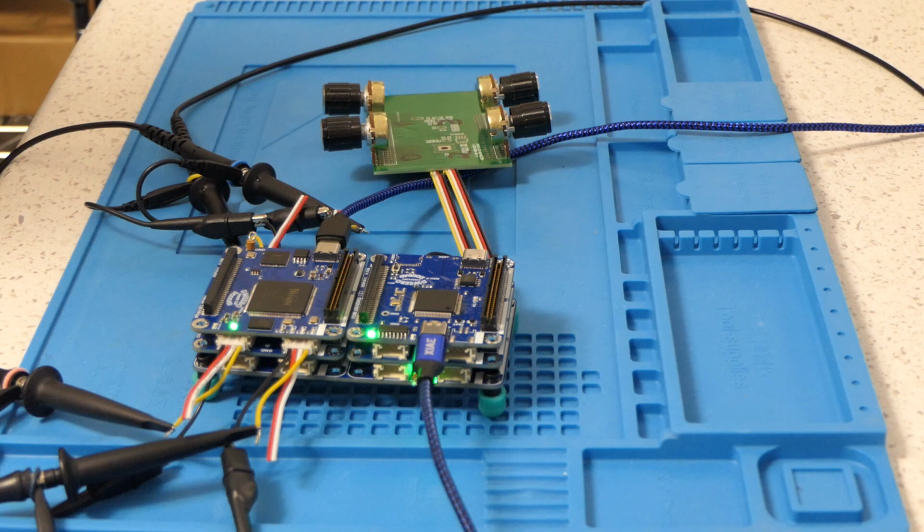To start with, it has 256K of flash, 64K of SRAM, 2 A to D converters. The one that I've used that I'll demonstrate here has 16 A to D inputs, 2 DAC outputs, 10 timers, 4 advanced and 4 general purpose, and 2 basic timers, 8 UARTs, some of them are USARTs, 3 SPI, 2 I2S, 2 I2C, USB on-the-go, USB high speed, plus an internal PHY, not bad. 2 CANs, real-time clock, 2 watchdog timers, 4 op-amp interfaces, random number generator, an SDIO.